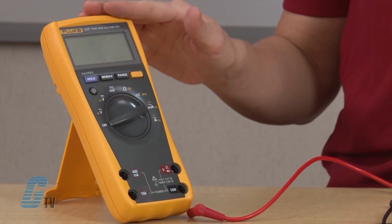When checking the condition of a diode or transistor junction, a multimeter is the preferred instrument versus an analog voltmeter. The voltmeter can give widely varying readings and can drive undesirable current levels of up to 50 milliamps through the junction. Many brands of digital multimeters have models that include a diode test function, like the Fluke 177 model that I'm using today.